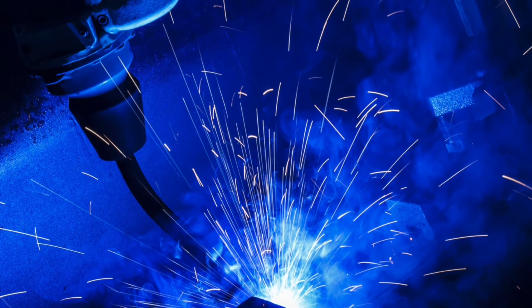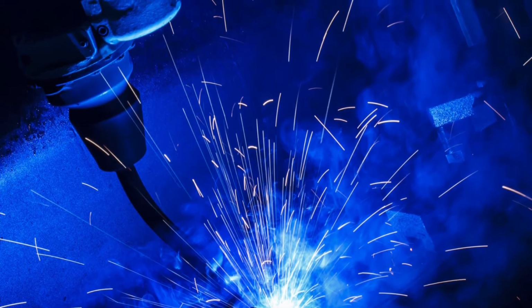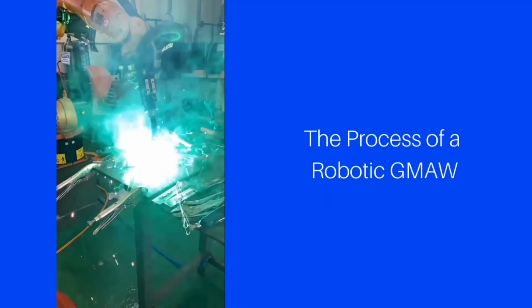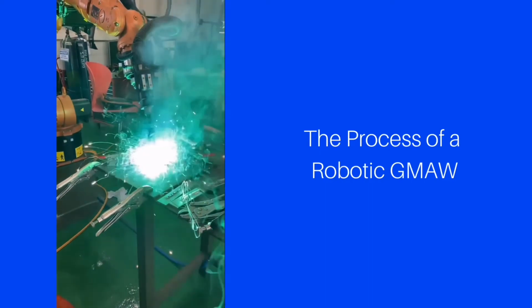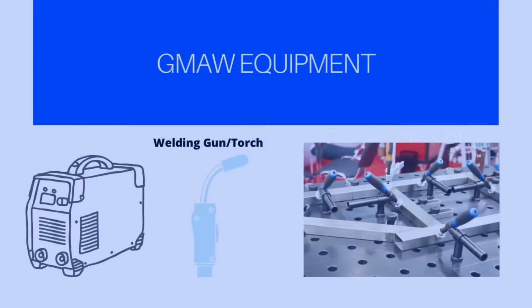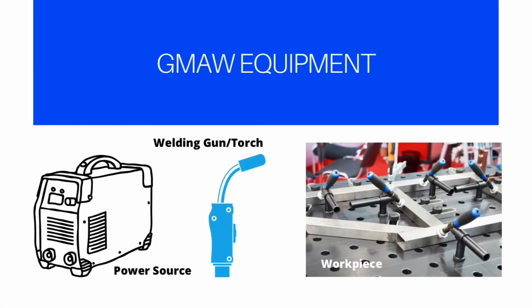Everyone, at the end of this video, you should be able to describe the gas metal arc welding or GMAW equipment. A GMAW equipment consists of number 1, the power source. The GMAW welding power source converts primary power from an outside electrical source to secondary or usable power at the proper current and voltage to maintain a welding arc.